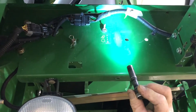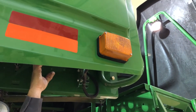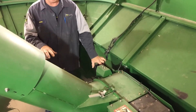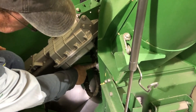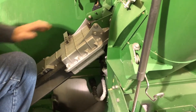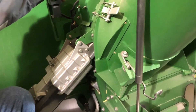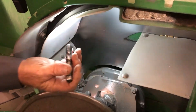This switch turns on the lighting for the engine compartment — it lights up your engine compartment lights. There are three of them and they help for night service. The rotor or bin loading auger gearbox — this is the dipstick for that gearbox. It uses 85W-140 oil, and it's just an opportunity to check and make sure everything's good.